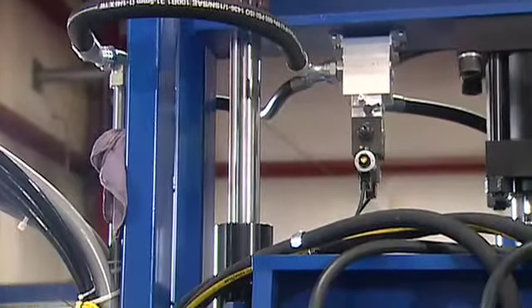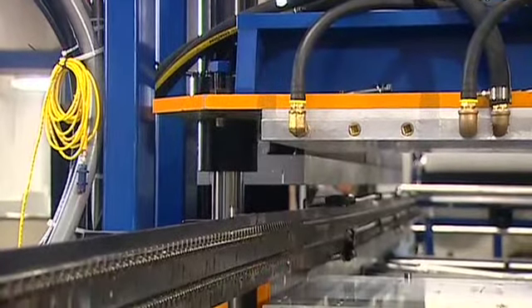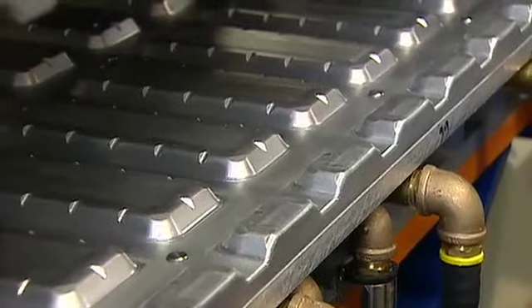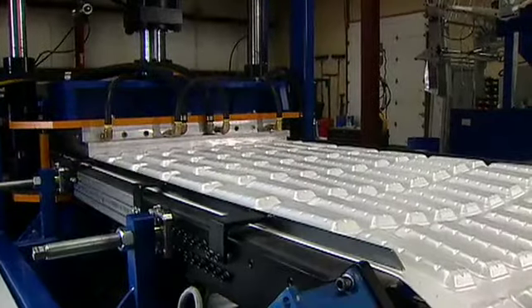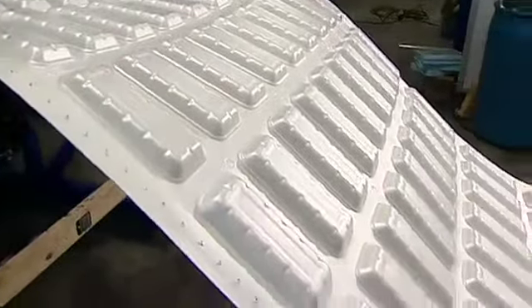We've developed this machine with flexible pins. They're there to take the force of the closure, not to position the mold. What we want the mold to do is flex a little bit so that it can become completely flat. We use internal stops in the mold and we want the hydraulic system to push down until all the stops hit their home. In addition to the internal stops, we've added a simple adjustment on the machine that allows you to make your part just a little bit thicker. If you have some process variation where your foam is thin on one side versus the other, this machine gives you the flexibility to turn those bad rolls into good trays.